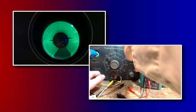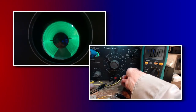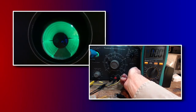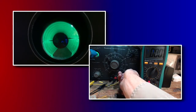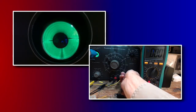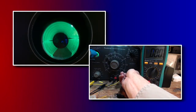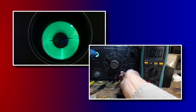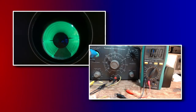Now we'll give it the high voltage treatment here. Put that over there so it's a little farther from my hand. There we go. See how fast that was? 150, 250, this is a 600 volt capacitor, 350, see how fast it was? 450, just about the same speed. So there's what a good capacitor should test like. So what am I learning from all this?